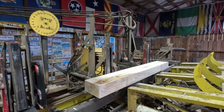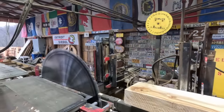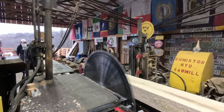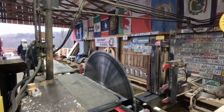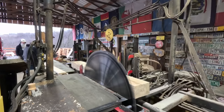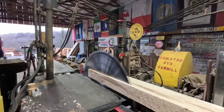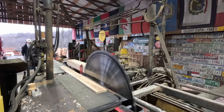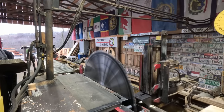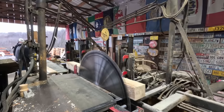See, I was somewhere around... Should be right around there. The width of that blade is a quarter inch. It's 9/32nds, okay. So it's a 32nd over a quarter. But you can sharpen it till you get down to a quarter inch before you have to change the bits. It's a dovetail shaped tooth, so as you sharpen it back, the kerf goes narrower. But as far as when I'm doing calculations on stacking, I pretty much calculate it as a quarter. I have cut sheets all over this cab, little cheat sheets.